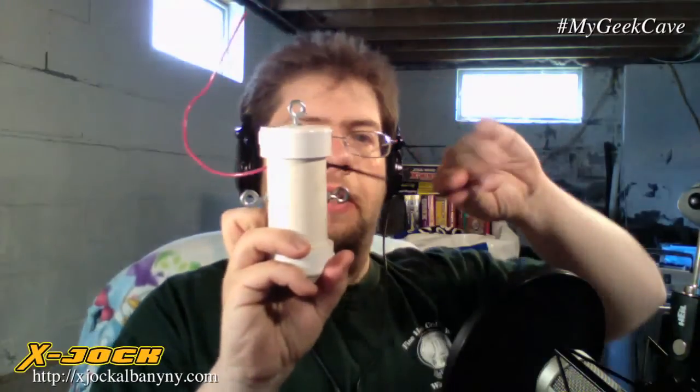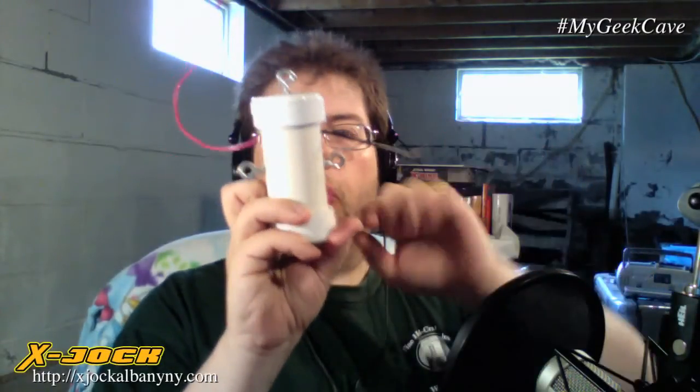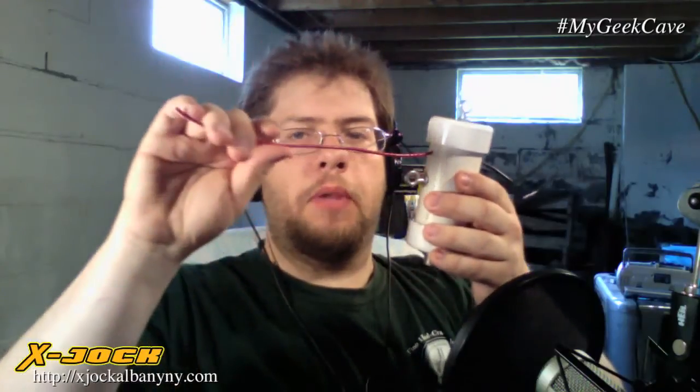This guy right here is the makings of a dipole antenna. Now if you're not a ham radio operator, you don't know what that is. A dipole antenna is basically a very simple antenna — two pieces of wire strung out to the correct length so they'll be resonant on a certain frequency that you want to transmit and receive. You just have to cut the wire and attach it to your radio using some type of coaxial feed.